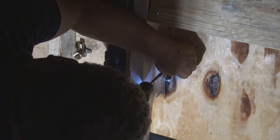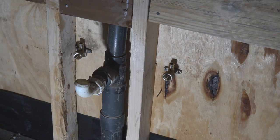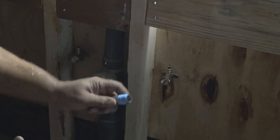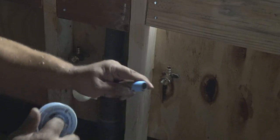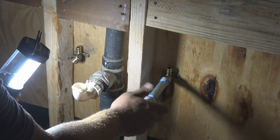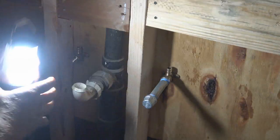I think a lot of people out there, especially some of you that have PEX pipe in your home already, could appreciate why I am using this hard rigid pipe here, because I know the systems that they have in a lot of the new homes that they're building. They're just stubbing the PEX pipe right out of the wall, and there's nothing rigid about it. It's just so loose and it just looks scary. So when you go to reach up under there to cut a valve off, it's kind of nerve-wracking. But here, when you reach up under your sink, you'll have a nice, sturdy, strong pipe where you can turn the water off and on, and if there are any issues, it's easier to replace that valve or work on any faucet up under your sink, as long as you have a nice sturdy cutoff valve and a sturdy piece of pipe coming out of the wall.